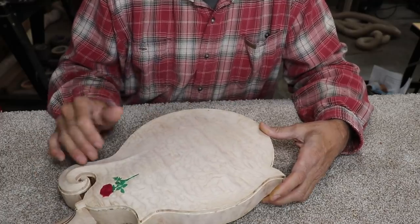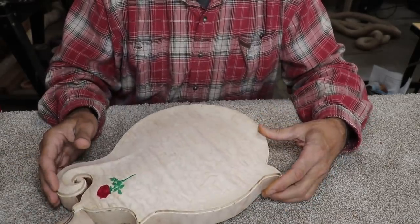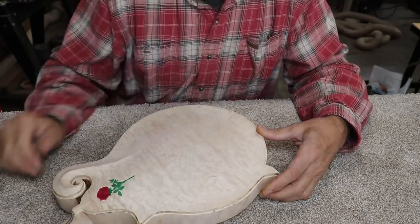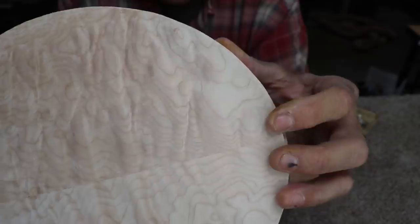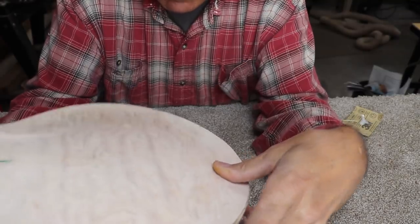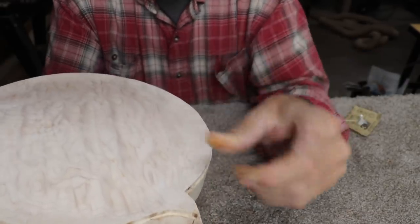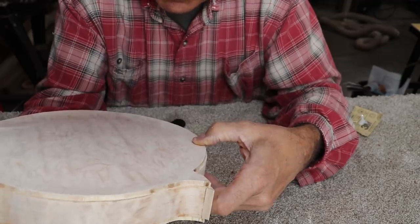As I told you, this wood has been a real nightmare to carve anyway. So I'm just going to go back over it again and maybe spend a couple hours just trying to sand it some more and get it just as smooth as I can get it before I start the staining. I have spent quite a bit of time with 320 sandpaper sanding this area here. And even after all that, I still see little tiny flaws in this wood where it just did so much of that tear out. So it's going to take a lot of work to get this perfectly smooth.